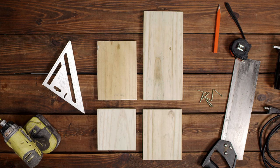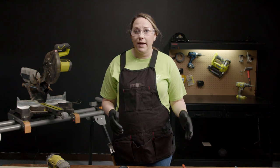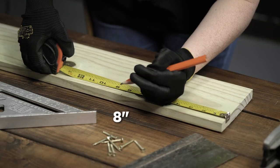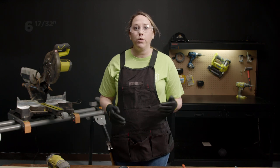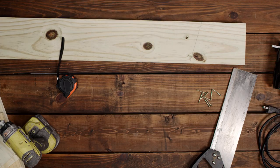The front of the house is 6 and 3/8 inches. The back of the house is 12 inches. The bottom of the house is 8 inches and the top is 7 inches. I am back and you may have noticed we don't have any sides — that is because they need to be angled and I want to show you how to do this. Start by marking the board at 8 inches; this is the back of the slanted side. You can use your speed square to mark a 15 degree angle, or mark the front at 6 and 17/32 inches. We did that math for you.